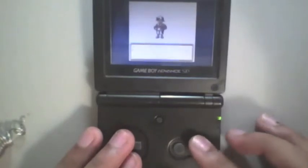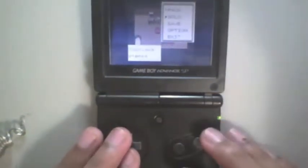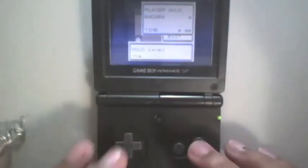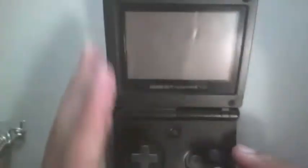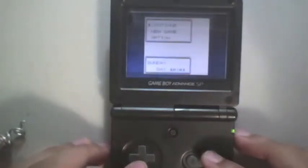As soon as we get past this, I'll save, and hopefully it'll keep a save file. So, there we go. Gonna save. There, I've gone and I've saved. Okay, save the game. Off. Take it out for a couple seconds to prove that it will keep a save. We can go ahead and pop our Gold version or whatever Game Boy game you're working on, and hopefully we'll see it continue. Continue. Alright, see? So now I am able to save my games, and I've got my new battery in there.